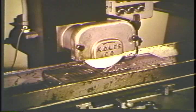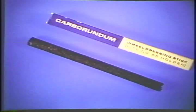Rough grind to remove enough material from the workpiece to bring the vertical surface to within about 1/1000th of what you want the finished piece to be. After this part of the operation, you may have to dress the side of the wheel again. If you do, just use an abrasive stick dresser and give the side of the wheel a light touch.